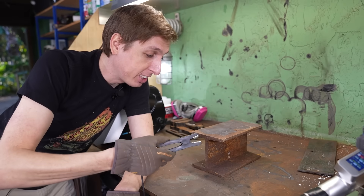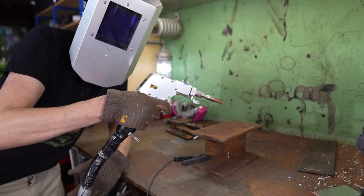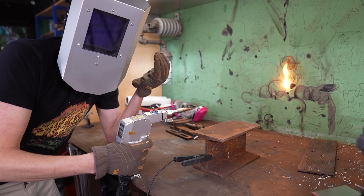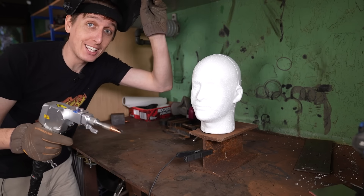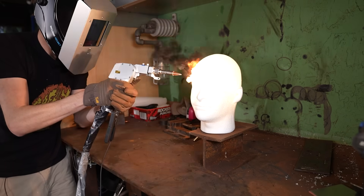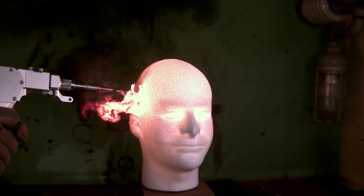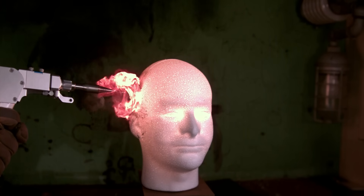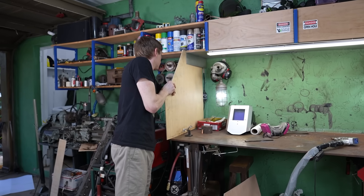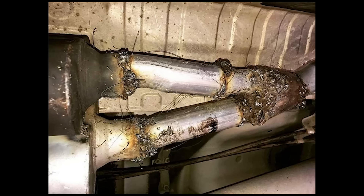You're supposed to put the safety clip on the piece of metal that you're welding, so the laser will only turn on if you touch it to the piece of metal — that way you don't laser your friends. But the whole gun is metal, so you can just touch it to the workpiece anywhere. If you do want to laser your friend, all you have to do is put the safety clip on the laser. Speaking of toxic smoke, laser welders seem to produce a lot more fumes than normal welding. I don't really want to breathe in a cloud of vaporized metal, so I installed a fume hood. My first welds with a MIG welder were an actual cognitohazard.